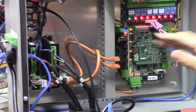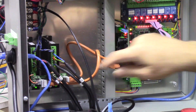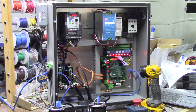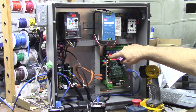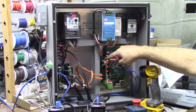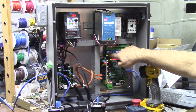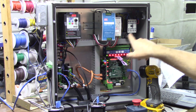Centroid does have a schematic for the CSD508 in a multiple-drive configuration, and if you follow it it will work. I'm going to go over the jumper settings to use the Leadshine drives with the C86. On the C34 board the jumper is set to hard enable and active low. On the C86 the jumper is for Acorn enable — I have it set to off, so it's not using the enables from the Acorn board. What I'm using is the no-fault input. There are pins that are waiting for a signal to set this board to its normal state, and I am running that through an e-stop contactor rather than the no-fault diagram from CNC PC.